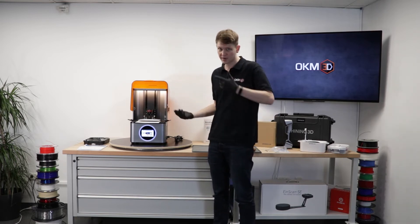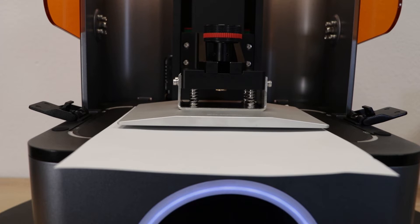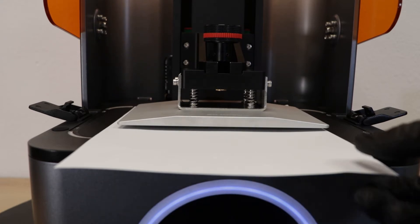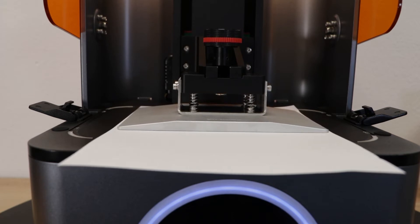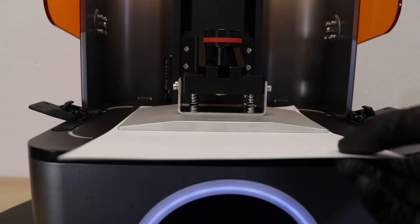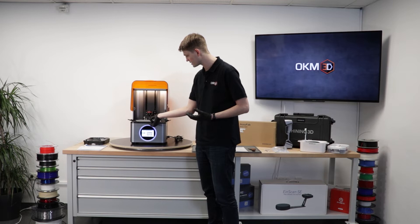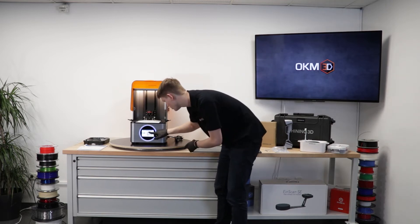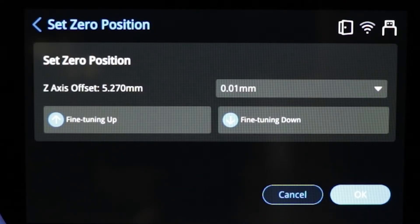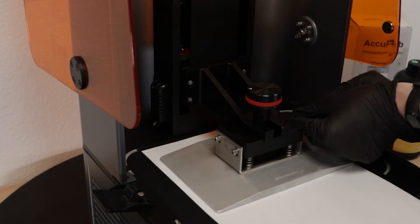I doubt we'll need that, but just in case, telling you everything. So right now there's still a tiny gap, but it says please wait — it's still moving down slower now. And that's why we have to loosen the screws. It'll actually press into the display a tiny bit. Thanks to loosening the screws, the display can just move up on its springs in order not to damage anything. So now I can test the paper and you can see it's completely tight in there. I can't move it at all, and that's perfect. Otherwise, I could use the screen to use the fine tuning buttons and move it up and down that way. So this is perfect. I'm going to take my hex key again and tighten the screws once more.